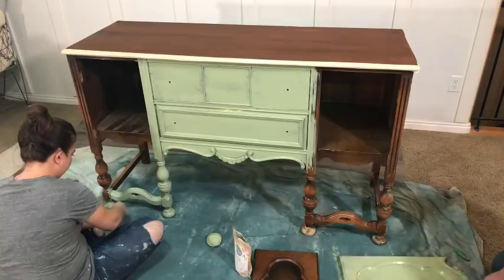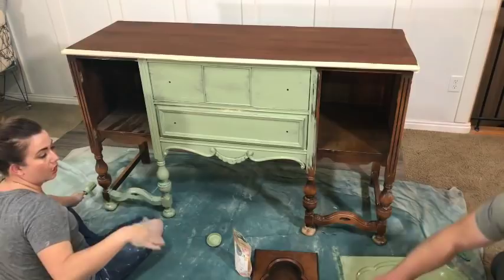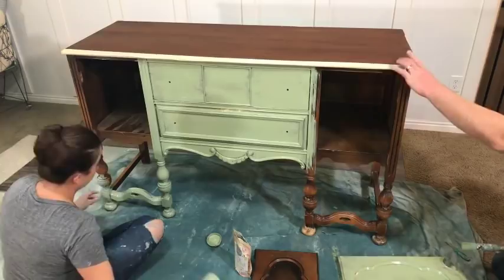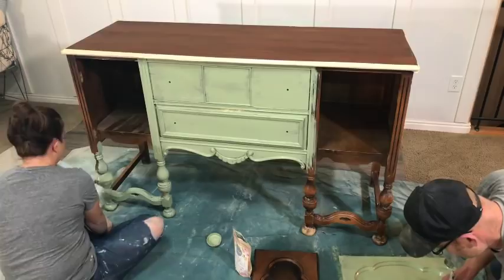Alright, I've got this door painted pretty good. The good thing is until it's sealed you can get it off with water, so if we get a little paint on the wrong side of the door, once it's dry we'll flip it over and clean it off with water to get a nice crisp line, then seal it. We avoid taping off if at all possible. I taped off the gel stain because I did not want to sand this top down again — it's a veneer, and veneer tends to be thin so you have to be careful.